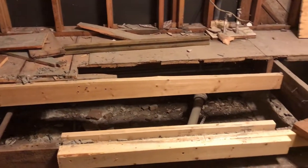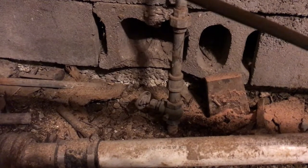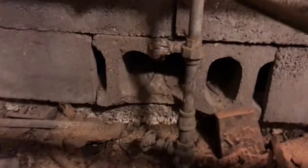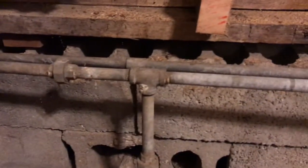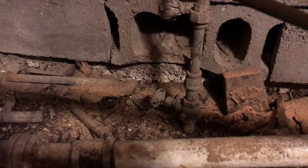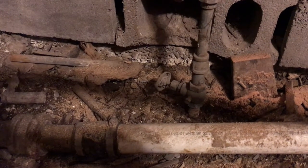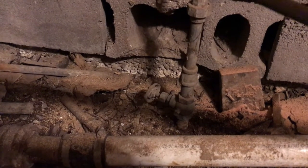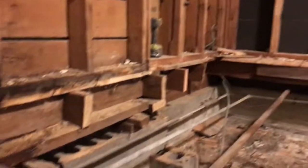We're going to fix all these joists, re-support them, try to lift the floor where needed, get it all leveled, and redo some plumbing while we're at it before we cover it back up with plywood. Here's another surprise — buried under the kitchen is where the main water comes into the house. There's the main shutoff, but you'd never be able to find it, and it immediately reduces down to half-inch pipe feeding the rest of the house and the water heater. I'm going to tie into the three-quarter inch pipe, run it to where the new utility room will be for the main shutoff, and run three-quarter inch to the water heater, only reducing to half-inch at sinks and bathrooms.